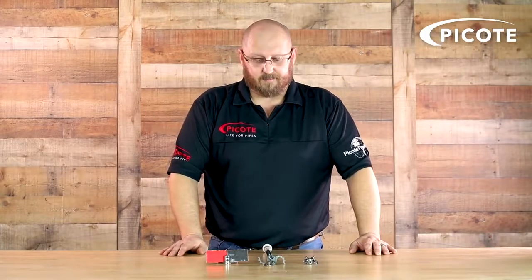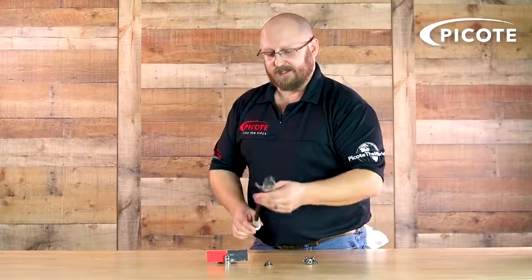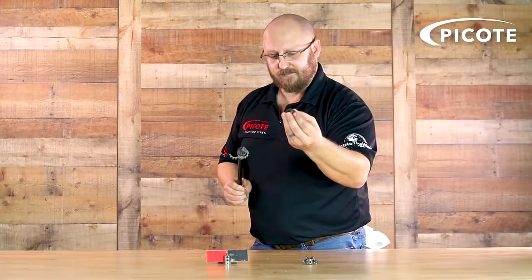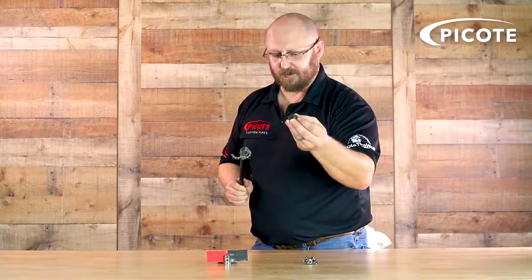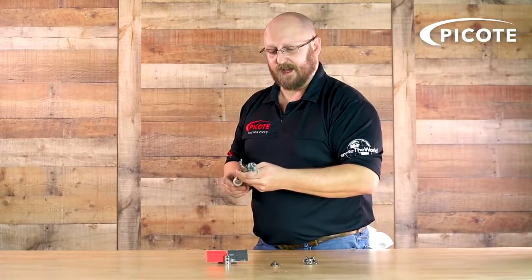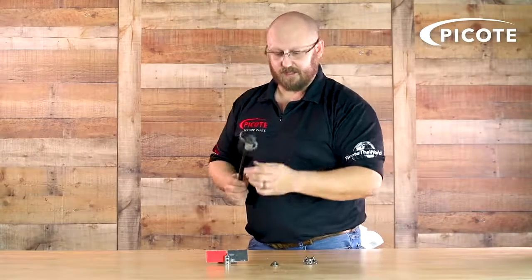In addition to that, we include the mini sweeper. We include this also in the cutting package, but what's unique about the cleaning package is, in addition to the sweeper body, we include a new drill head. The drill head is designed for burrowing into tough blockages as required. Maybe it's a hard grease blockage, or something similar that you need to grind into, calcium deposits, maybe in a urinal or floor drain. So it's very good for that sort of thing. Again, that comes with the self-adjusting head. As you can see here, the arms will flail out. This leader is not included. This is for purposes of demonstration only. Just the head will be included in the kit.